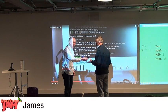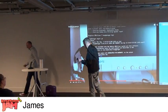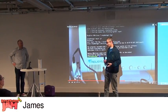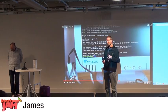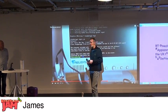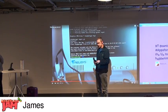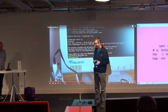Tell people what the problem is and how they can fix it. Most people who use Raspberry Pi use a power supply from a phone. Raspberry Pi doesn't come with a power supply, so they use it with the phone. The standard for all phones is probably only about 500 milliamps — that's how much current it can supply, effectively how much power it's going to supply. So one of the common causes is you're using a power supply which is not rated enough to supply enough current to the Raspberry Pi.